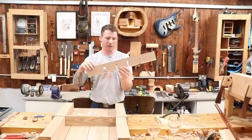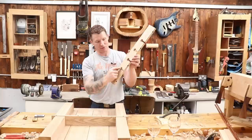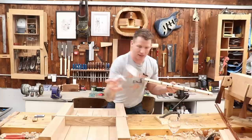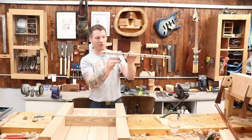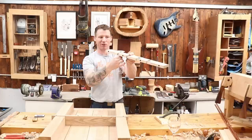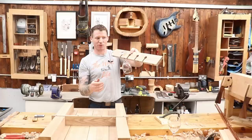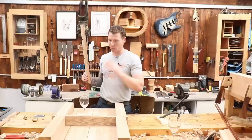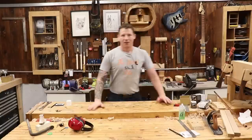There's the piece made for our wine glass holders. I drilled a 25mm hole with the Forstner bit on the drill press, then took it to the bandsaw and cut these out. From the center line I measured 5mm either side, so the gap is not the same width as the hole. That allows the stem of the wine glass to fit in nicely and hang down, giving just a little bit of security — because the widest part at the end of the glass can't pull out. You have to lift it and then take it out, so it's a nice little safety feature to stop the glasses from sliding out if they get bumped. Now I'm going to sand everything to 240 grit and then start to assemble.